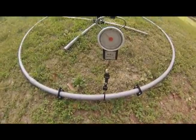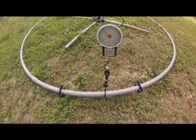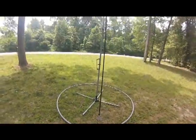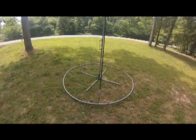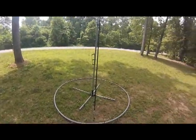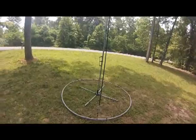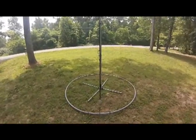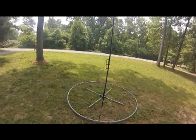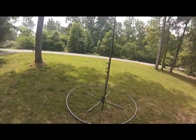This has been the sixth day and it looks like we've lost about six or seven pounds of pressure — we started out at 50. That's probably attributed to a little bit from here and a little bit of the banding material may have stretched, and the other factor is the heat. Over the six days the temperature probably averaged 85°F, possibly close to 90 some days. Right now it's in the shade, but some parts of the day it'll be in direct sunlight.